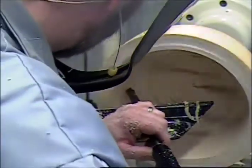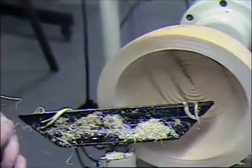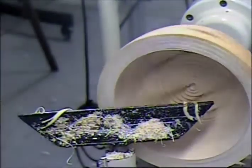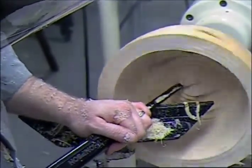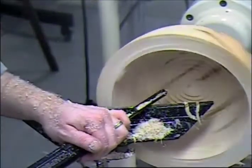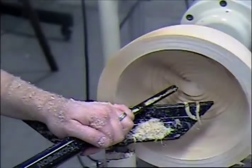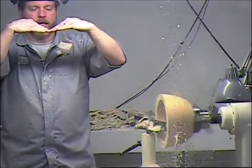And the last cut over here, start swinging to create that curve. So we got about 1/2 inch more to go. Since I've only got 1/2 inch or so to go, notice I've changed my approach. Instead of being straight in, I've changed my approach so I'm more at an angle. So instead of creating a V like this, I'm creating a shallower V.